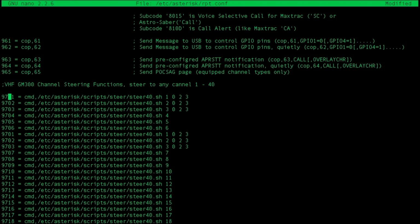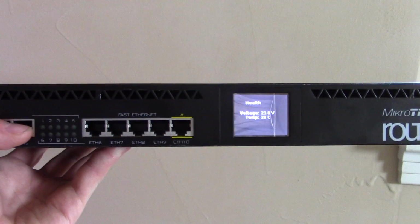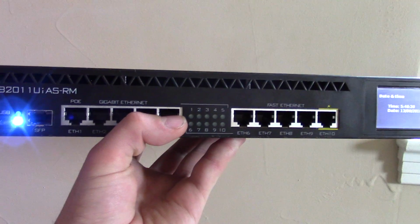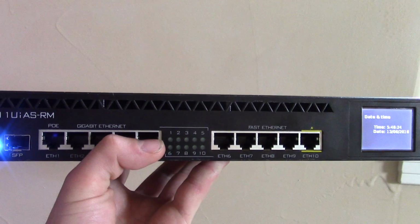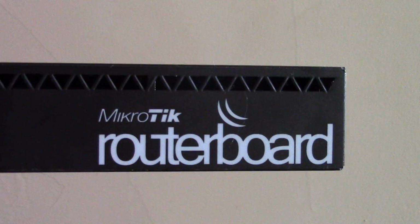that's basically it for channel steering. There's other configuration, but for channel steering, I think I covered it. Here's the router that we'll deploy up on the mountain. It'll take the wireless internet service provider and give us internet to the Raspberry Pi, both the remote base and the AllStar linked repeater. It's a MikroTik Linux router, and for about $100, this router does everything a $2,000 router can do. It's Linux, so it's a little harder to use, but programs like Winbox make it pretty easy.